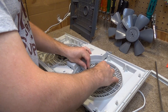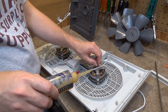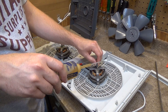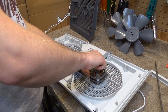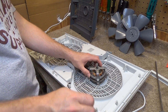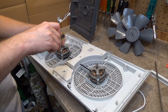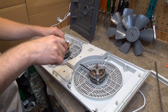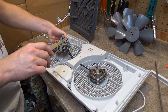It's really a shame because these are decent little motors. Maybe what I'll do is when the control quits — not if it quits, when it quits, which I'm sure will probably be before the motors — perhaps I will redesign a new mechanical control system for it so that I can keep using it. Because these are PSC motors and the bearings are pretty good, and they're reversible, which is becoming pretty uncommon. And I'd hate to toss them because of a stupid set of Chinese electronic controls.